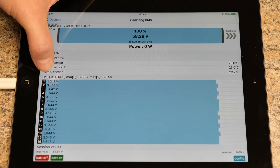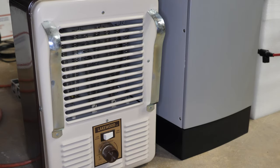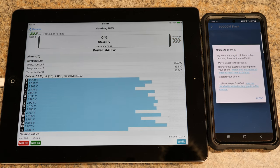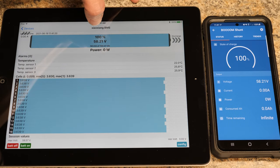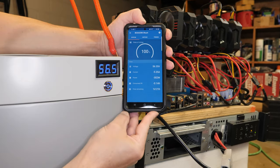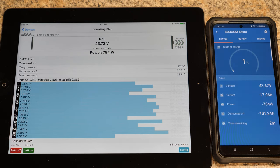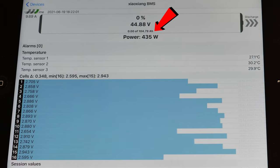I charged the battery to full charge — all cells came into balance with a 10 millivolt delta between the highest and lowest cell. First test with the space heater at 1500 watts or 30 amps lasted around 3 hours and 15 minutes. The battery hit low cutoff at 43 volts, cell number 16 hit the low cutoff at 2.5 volts, the BMS disconnected the load, and we ended up with a capacity of 104.07 amp hours. Second test I charged back up to 58 volts, all cells came into balance again, ran the Ravencoin mining rig at 600 watts or 15 amps. Six and a half hours later, cell 16 again hit the low cutoff at 2.5 volts, battery disconnected at 43 volts, and we got a total of 104.79 amp hours.